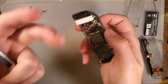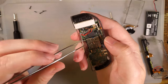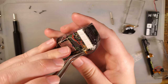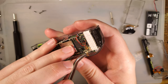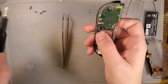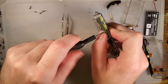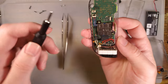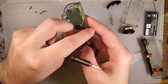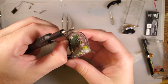So in reading about how the iPhone fuses its backlight and protects that, I found out that yes, indeed, 0-ohm resistors are used as fuses in some cases, and this appeared to be one of those cases as well. Now, don't get me wrong, it would be wonderful if, oh, I don't know, maybe Nintendo themselves would publish the specifications for this part, because I am 100% sure I am not the only person who has run into this issue. But I can also tell you that bridging the fuse is not the solution. We want to replace it.